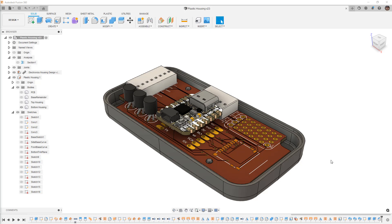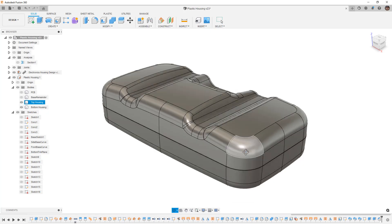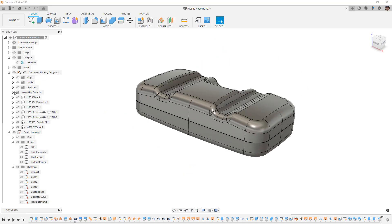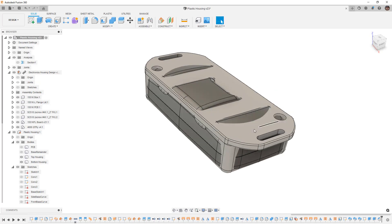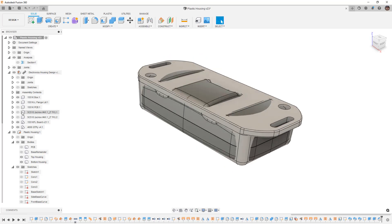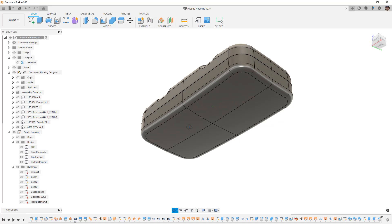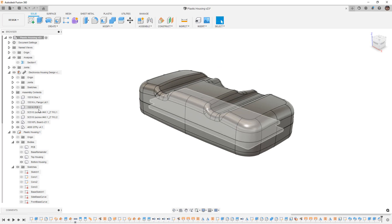Initially when we talked about this, we discussed that the screw bosses could go in either direction. We need to determine whether we want the screws to come in from the top side or keep the top completely clean and have them come in from the bottom. Hammond had them come from the base plate flange in that direction, intending it as a mounting flange. In our case it's flipped — we're mounting from the bottom with zip ties over the top, so we want our screws to come in from the bottom side.